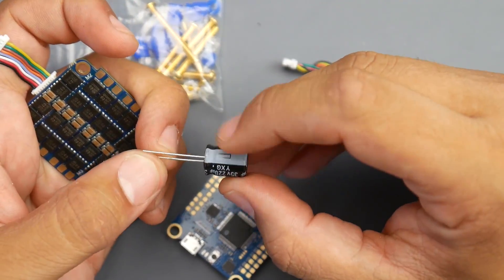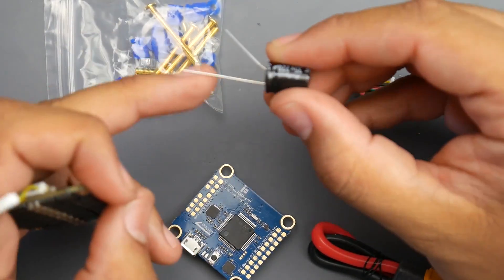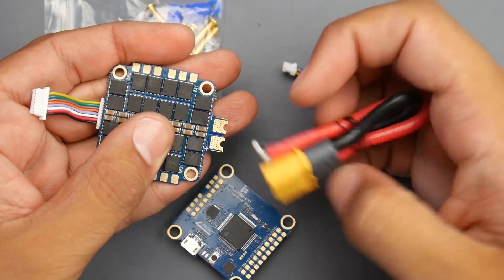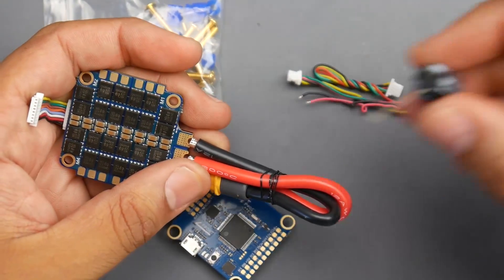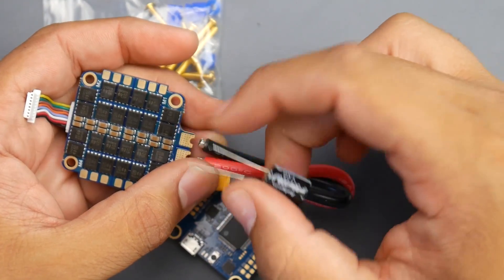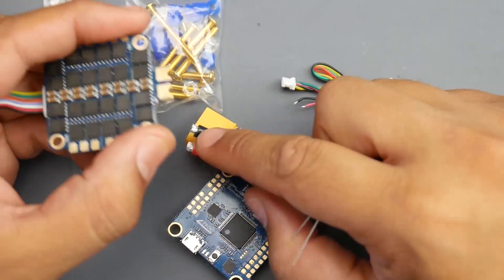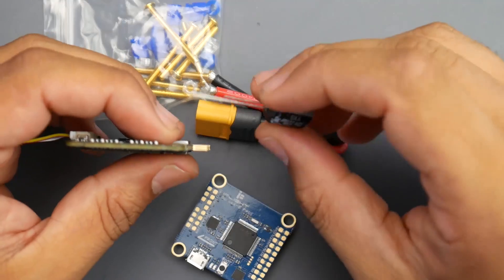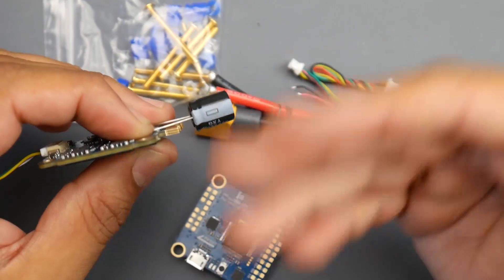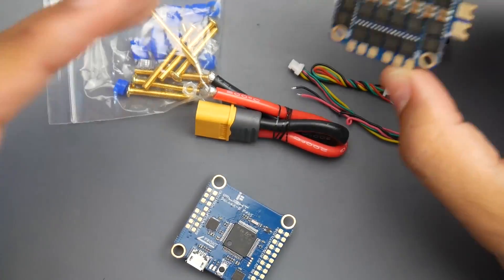If you don't know how to add the capacitor, first find the little minus sign or dashed side — this means ground or negative. The other side without any marking is positive. When you install your XT60, you'll see the minus and positive pads. Those would be soldered into place, and you'd also want to install the capacitor with those. Trim it up a little — the negative goes to negative. A nice tip: install the motor wires from the top and bring the capacitor in from the bottom, because it takes time for heat to transfer. Do this outside the quadcopter to make your life easier.